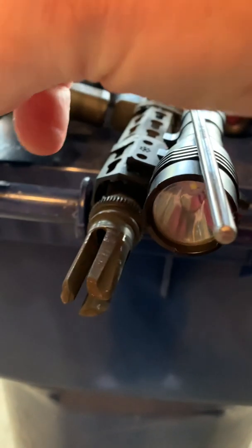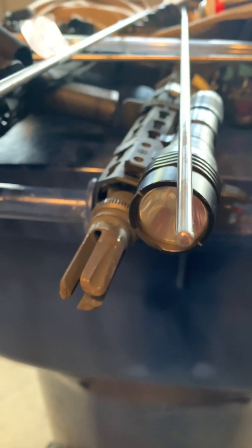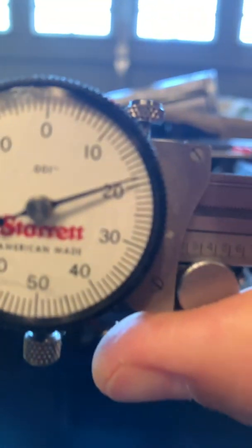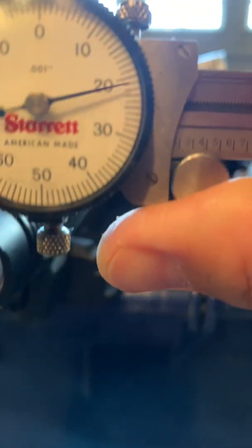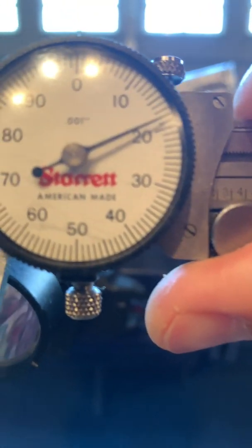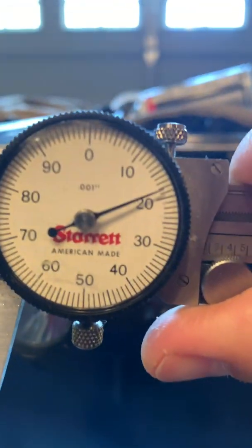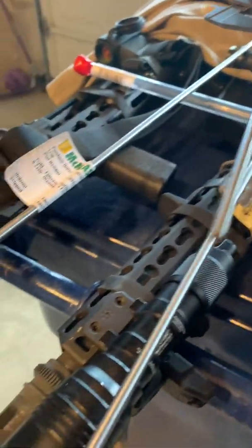This is the cut end they did — I deburred it a little bit. This one they also cut the end and I ground it down to make it smoother, otherwise it's kind of jagged. We're at 2.219 — trying to get my caliper more square — and about just over 2.218 on the end. This one I've already measured as 2.217, but I'll do that again.